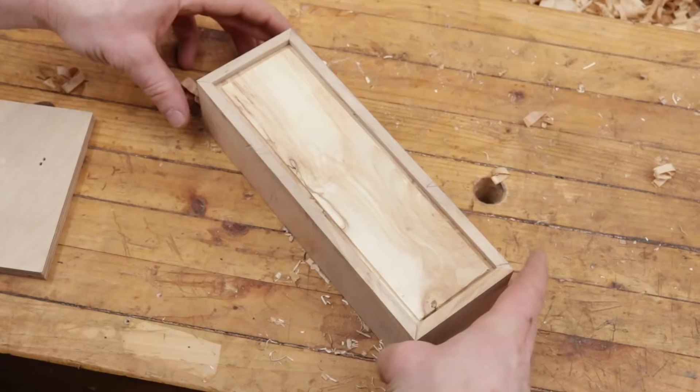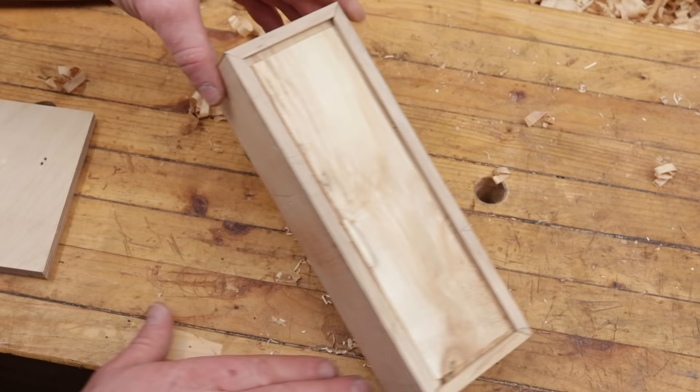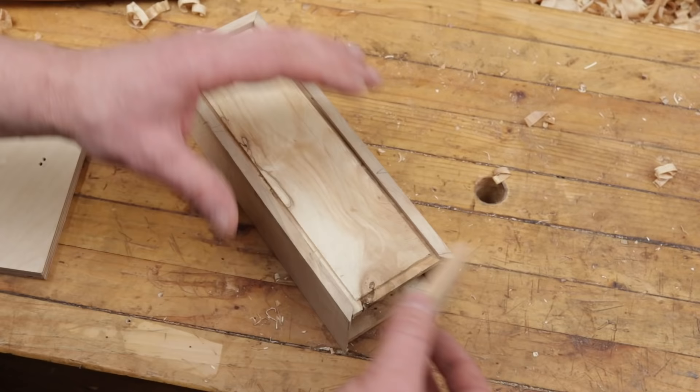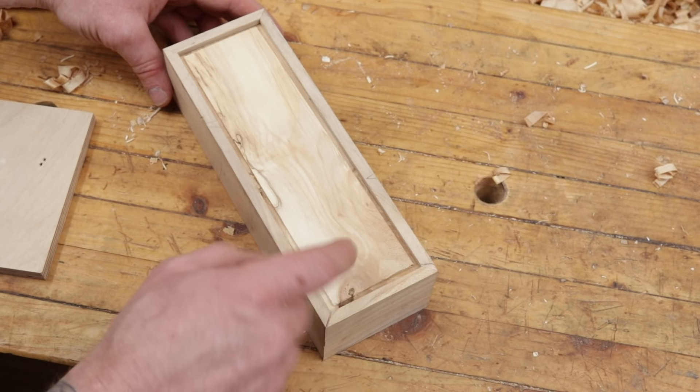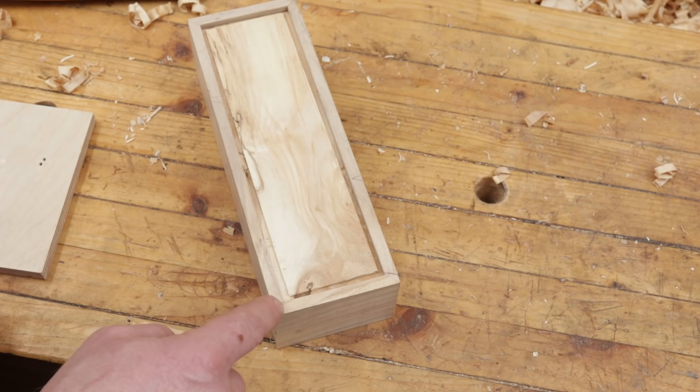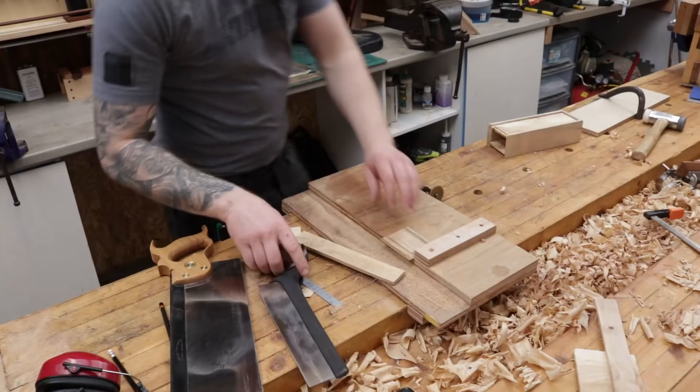We need to cut off the front rebate of the front of the box because the lid is going to slide in through there. The lid is made the exact same way as the base — just make the rebate on the side a little bit deeper so it slides easier. We want to cut the front piece off but maintain the look of the box, so we'll glue the cut-off piece back onto the lid so it can be used for pulling the lid in and out. When the box is closed it should look exactly the same and you can't see how to open it.